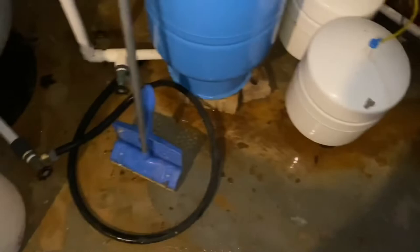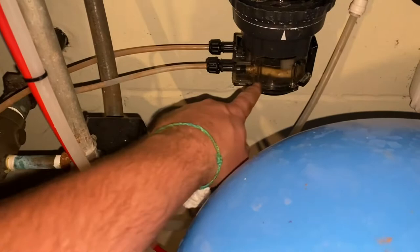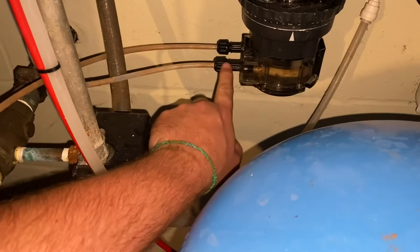So back up — you can see my floor is all wet because it's been leaking. That's obviously how I knew it was leaking. But this connection isn't leaking anymore. There should never really be any water in there unless your tube wears out and starts leaking. So I'm going to flip it back on. To get that to turn on, we need to get the well going, so I'm going to come over here and open this up on the big tank so that it drains out. Then it already kicked on — it didn't take much. You can see that working, and it pulls the tube. By rotating like that, it creates a suction that pulls it from here out to the big tank.